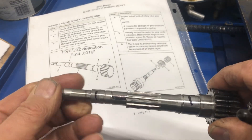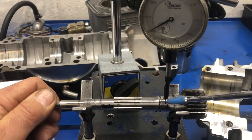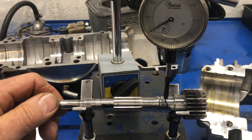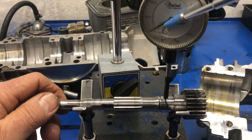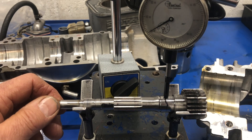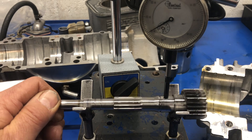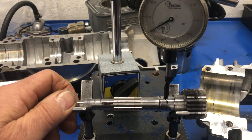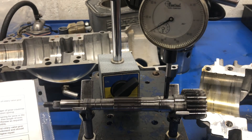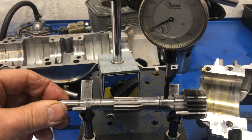Here's our indicator mark that I marked, and I already have the dial indicator located there. The dial indicator isn't zeroed, but for the purposes of this it doesn't matter because I just want to see what its total travel is. So we rotate the shaft, and we're watching the needle, and it does not move at all. See, it does work. There's no movement there at all.